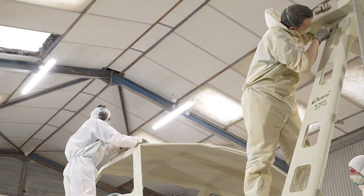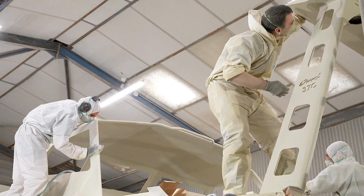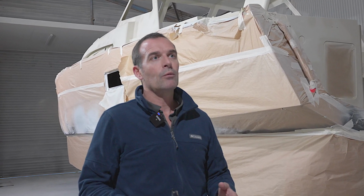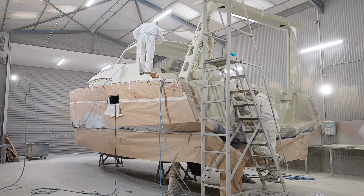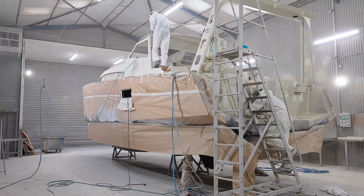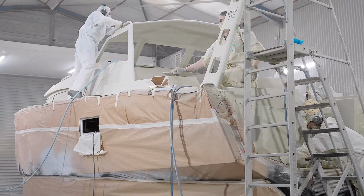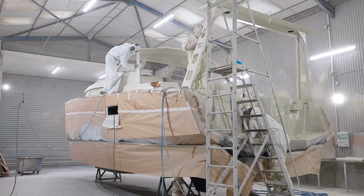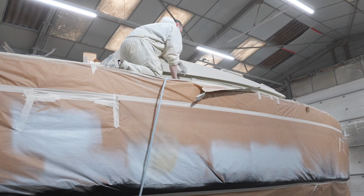One important thing is we work in a controlled area, which means that we control the temperature and the hygrometry. We need to be able to have a stable environment for the paint to cure properly. The first layer of paint is the most important. You have to paint aluminium before alumine builds up again. That's the most important. Our boat stays 4 weeks in the paint shop.